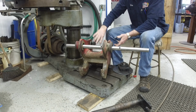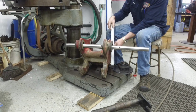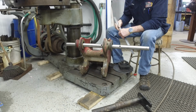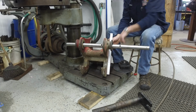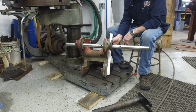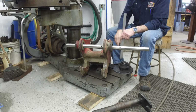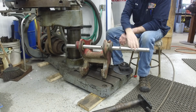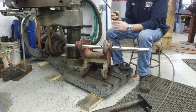Once we have that, then we're going to take and we're going to set this up. We'll block it. We'll take a look at our sides, see which one is less deformed than the other one. They both have a little bit of bending or deformity down in the bottom section there, but the rest of it looks pretty flat. We'll toe clamp that to the base, and then we'll pick the height, have plenty of clearance, and we'll be able to attach our bar.